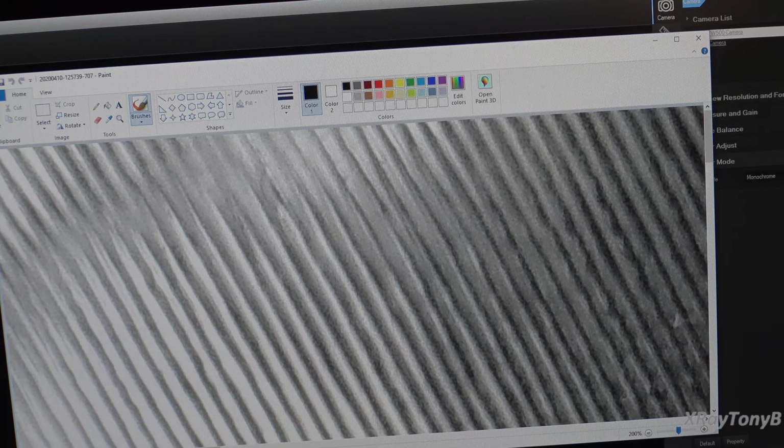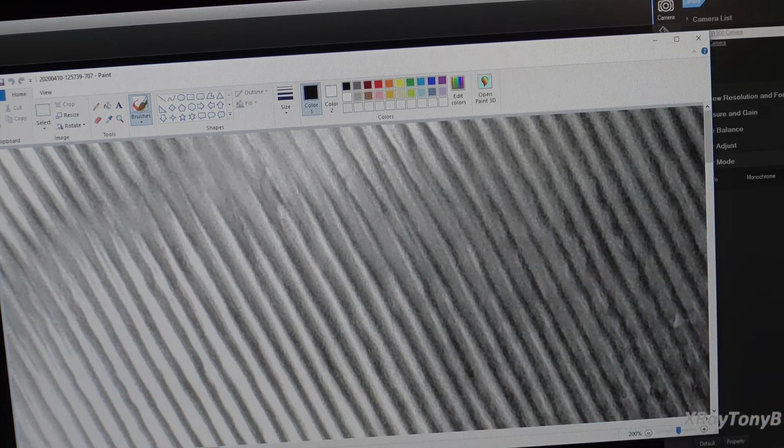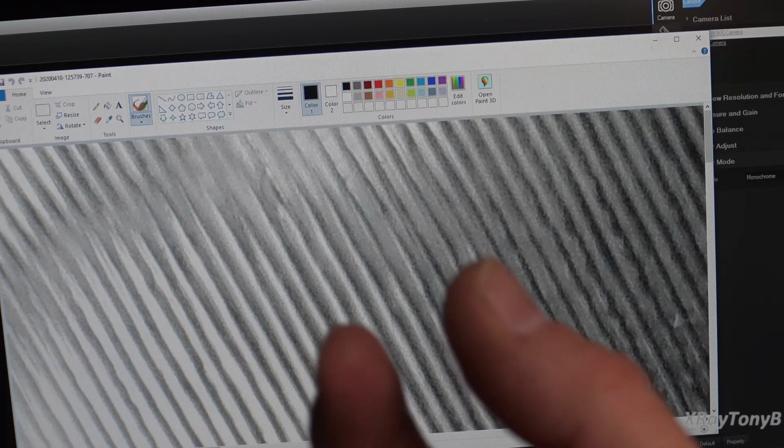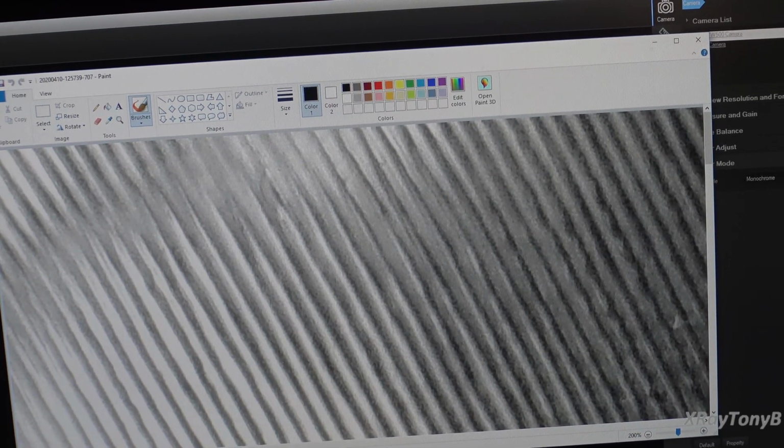So what we're doing is changing the actual amplitude of that frequency. At the lower frequencies, we're putting in lower amplitude so that the stylus travels less distance. And at higher frequencies, we're putting in a higher amplitude so that it travels more distance. It equals out so that no matter what frequency we put in there, it's always moving the same or a similar distance within that same width of the groove, if that makes sense. It's all physics and math, really.